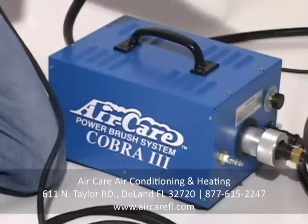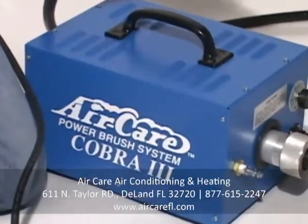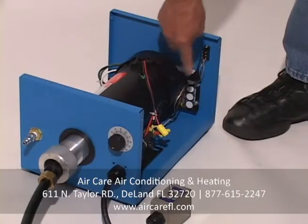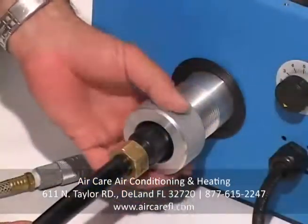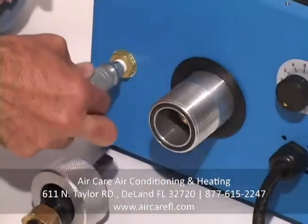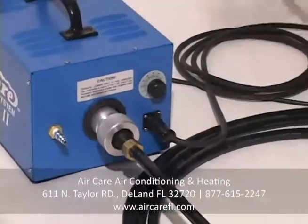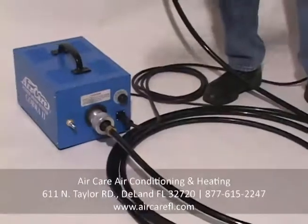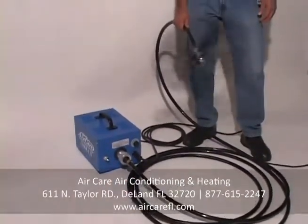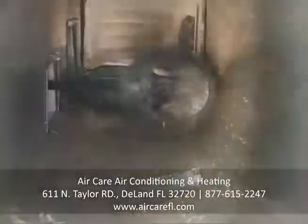This is the AirCare Cobra Power Brush System. It consists of the drive unit containing the variable speed DC motor, the electronic controller, the coupling for the brush drive cable, and a compressed air fitting to attach a 125 psi air source. The standard cable and brush assembly is 35 feet long with a flexi brush for 4 to 18-inch ducts. This combination is suitable for flexible as well as round and square steel ducts.